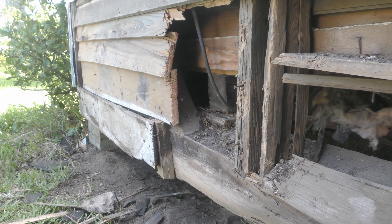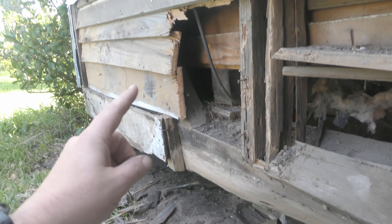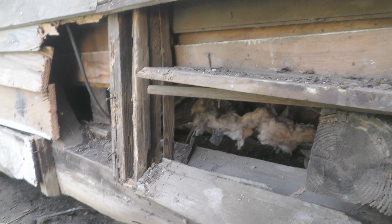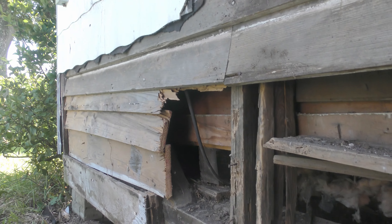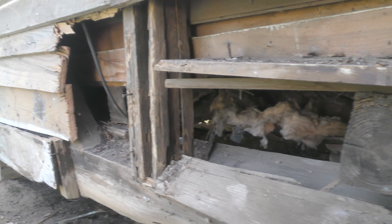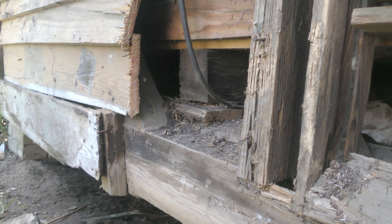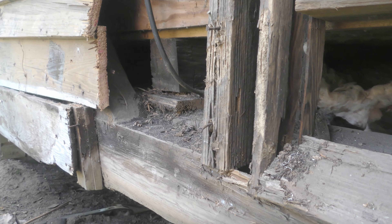My plan is to get the weight up off the sill plate — the sill beam — right here. I've got to support the outside wall, probably with a couple of 2x6s to span those openings. This is not a traditional structure where there's a 2x4 stud every 16 inches. There's a big fat beam that runs up the house the whole distance — goes all the way up to the roof and down. The joists tie into it. You can see here that the joist is notched. Somebody in the past has tried to jack it up — you can see right there where they've used some wood to prop it up, because this sill beam was rotting out.